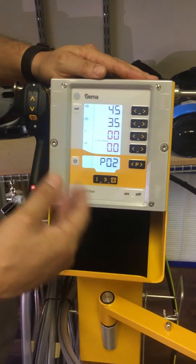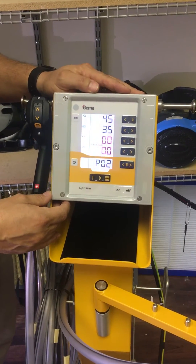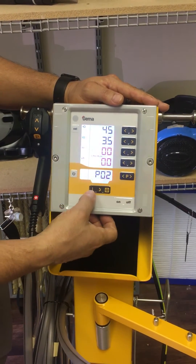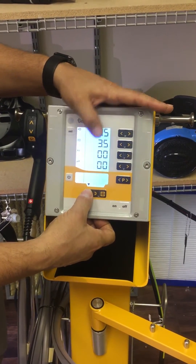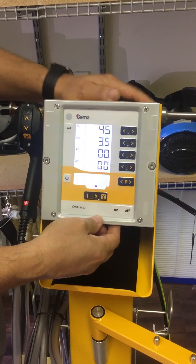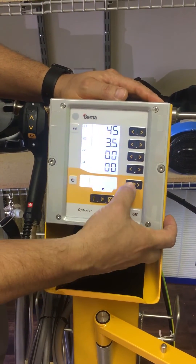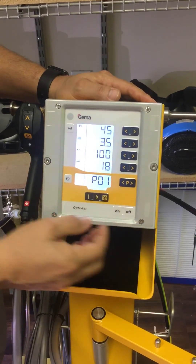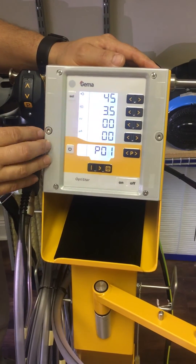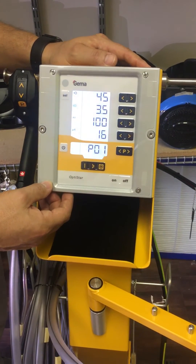This will allow you to do multiple coats — three, four, and five coats — without getting as much back ionization, depending on how much you put on the first time. These are all good starting points for your process. Flat panel: 100/100, no limitation. Complicated: limit to 22 microamps, non-adjustable. For an extreme complicated part, go to Program 1 — 18 microamps is a good starting point. If it's working well, stay with 18. If you're still having trouble, these are adjustable, so turn it down until you find the right setting.